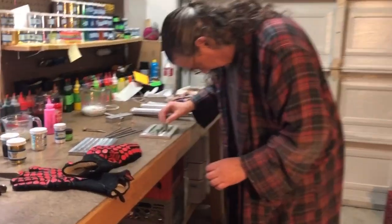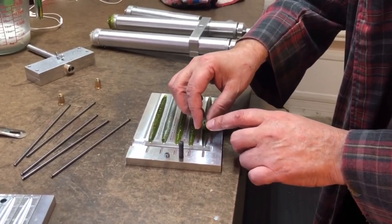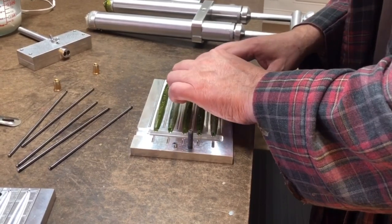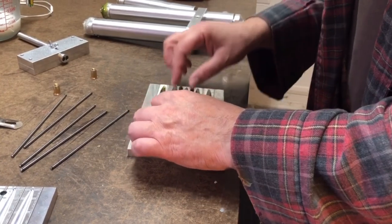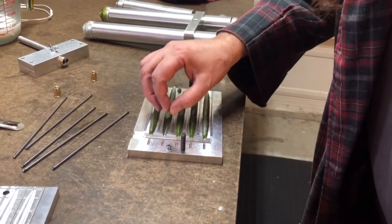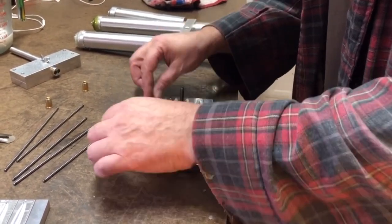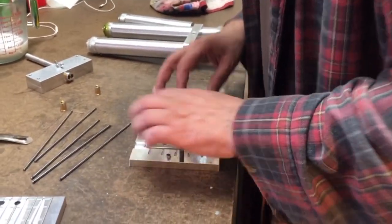When we put these back in, I have to make sure that the ends here are open — the gate area around the rod is very narrow. I also have to make sure that the tails don't get pinched when I close the mold again. If the tails get pinched, I'll end up with hollow tails, which isn't necessarily a bad thing — sometimes I do make them like that. But today we want those tails to fill all the way down. All right, that looks good.